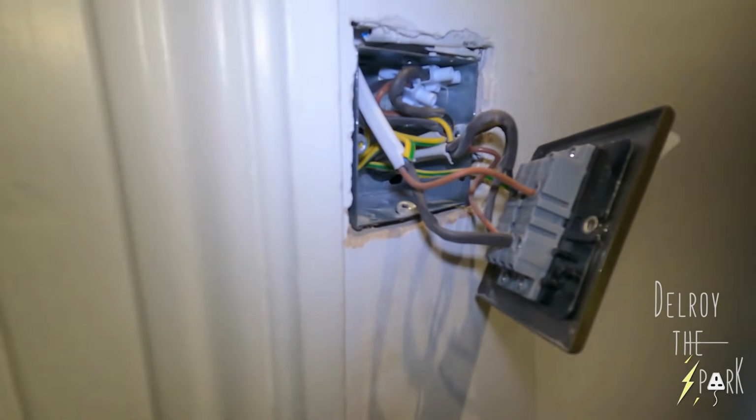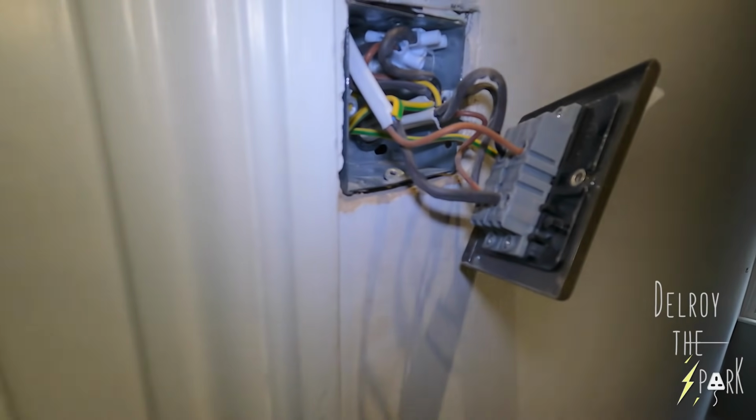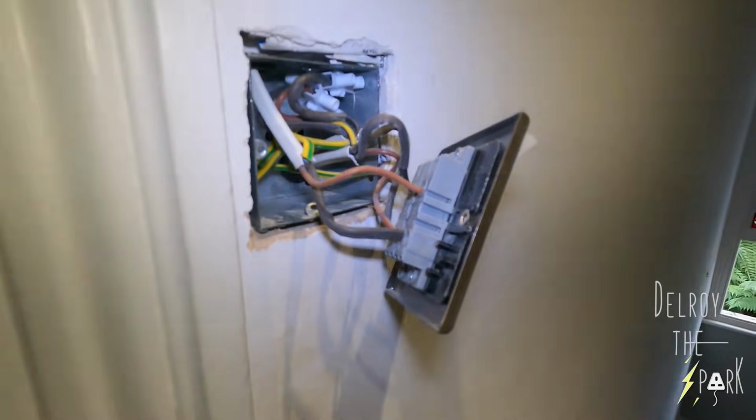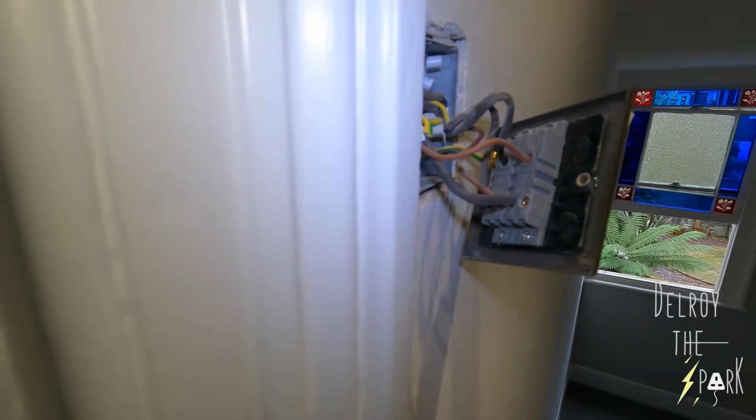Went downstairs, tested the wiring. I'm getting live on some of them, but not on others, on this leg of the two-way switching. So something's wrong. Downstairs works fine, no problem. Switch it on and off from either position. This one's not working at all. So I've had to put it on just single switching for now.